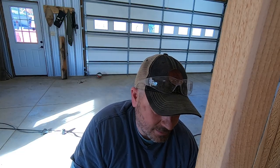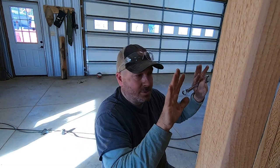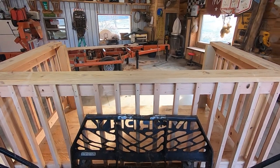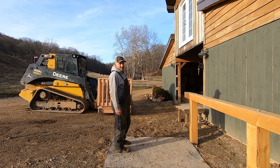Change of plans — imagine that! I didn't like how fabricating this offsite would affect my angles and how the tension would be. So I'm going to get this bottom plate put in place, and then the top one I'll get set on the side of the barn. I've got a buddy with a mobile welder — he'll come out and we'll weld that suspension rod in place once the deck is set, so I can get both angles correct. I'm worried about coming off all wonky, or the top plate that goes against the building being off. I think welding in place will give us a better finished product.